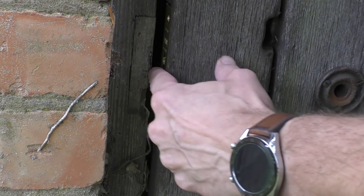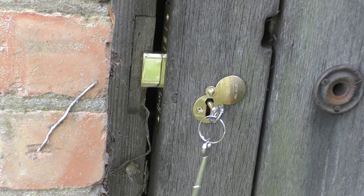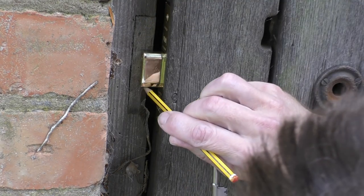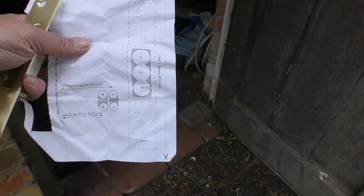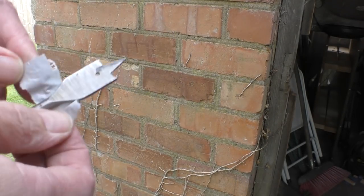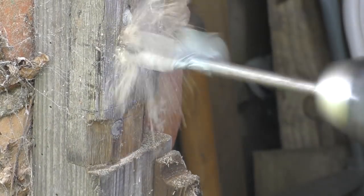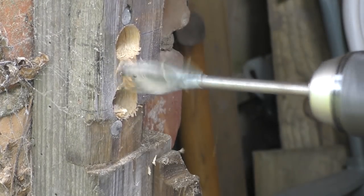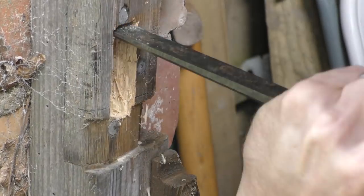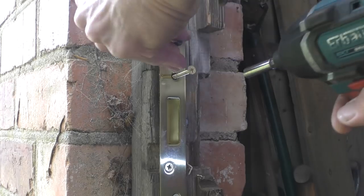There's a gap between the door and the frame I'll need to resolve at some point, but for now it's better than not having it locked at all. We've got about 12 millimeters of deadbolt poking into the door, and I won't rebate the lock box. It's now just a case of marking the deadbolt position against the door frame. Taking measurements from the lock box template, I check the location by measuring the center of the deadbolt to the edge of the door and transcribe this onto the door frame. After another hastily improvised cloth tape depth stop, I drilled three 20-millimeter holes in the frame for the lock box, doing my best to navigate around galvanized nails left by the previous owner. Notice how the drill bit slipped between holes in this soft pine compared to the precision in the oak door. A little tidying up with the chisel - which, along with the drill bit, was unfortunately damaged by the hidden nails - and the lock box was screwed into place, with no need to pilot the holes in the soft pine for the brass screws.